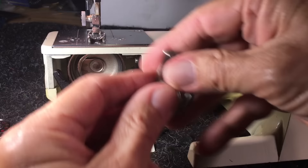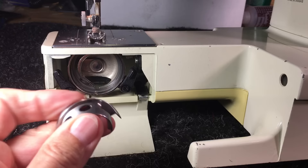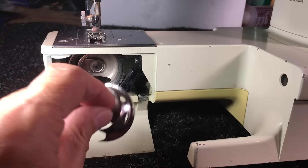It's the race assembly. The race assembly is a very soft metal; chrome is very hard. The chrome will grind away at that and you'll get little black markings on your thread — you'll wonder what that is. That's metal shavings. So put a little drop of oil on that so this runs on a slim little layer of oil. Just a drop is fine.